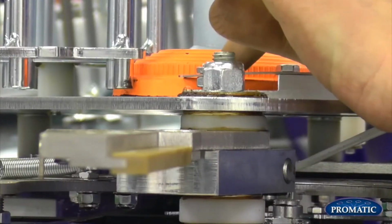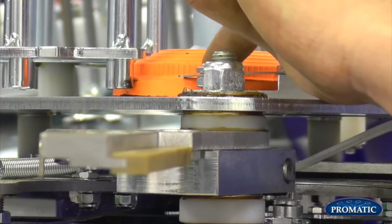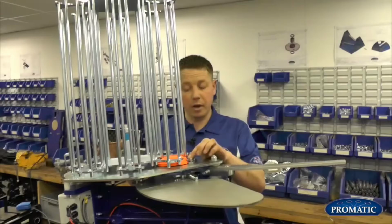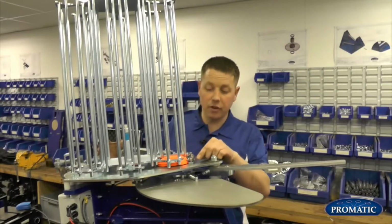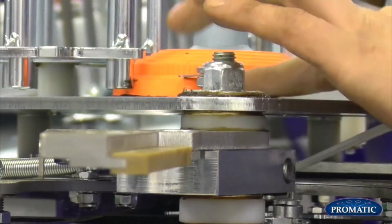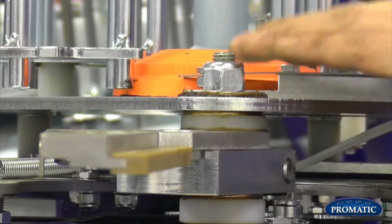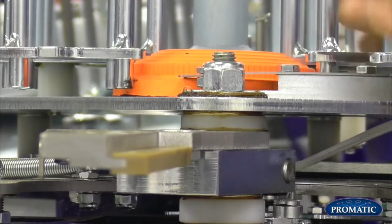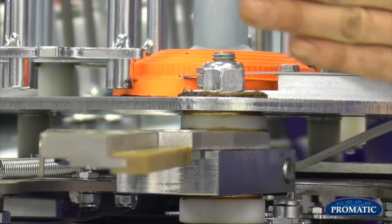So we're looking for a couple of millimetres from the inside of the blade or the outside of the blade at the one at the back. And regardless of the thickness, we're talking about the thickness of your thumbnail, which is located. You have a nut there which you can raise up or down. It's the same at the back. All the knife edges are slotted, so you can move them in or you can move them out accordingly.